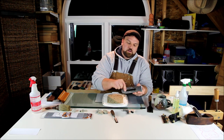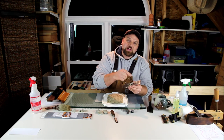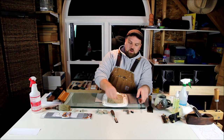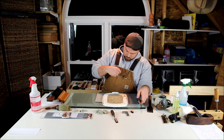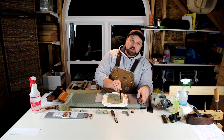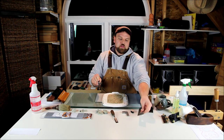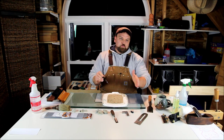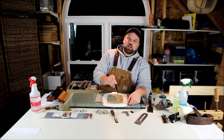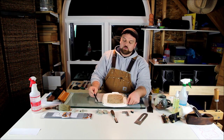This is not a surface that I'd want for an edge. As you come up to the edge, there's all these peaks and valleys which, to the naked eye, may appear sharp. However, when you go to push that blade across the grain of wood, it tends to want to shear along the peaks and valleys, which leaves you with a jagged cut and not something necessarily safe to use.